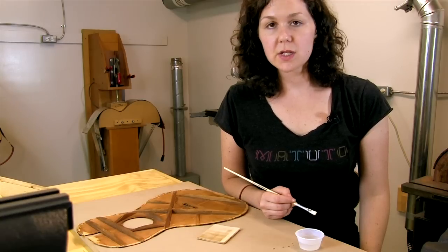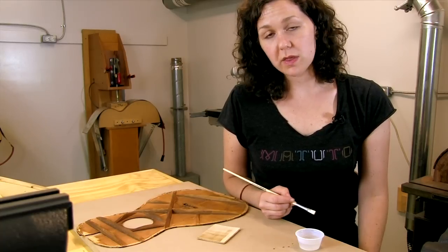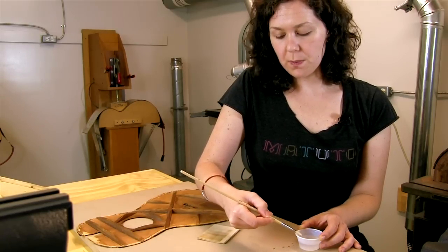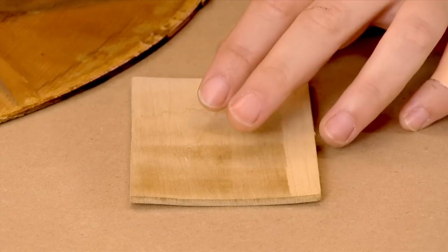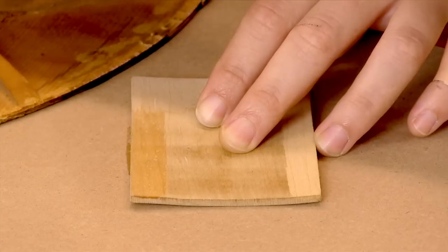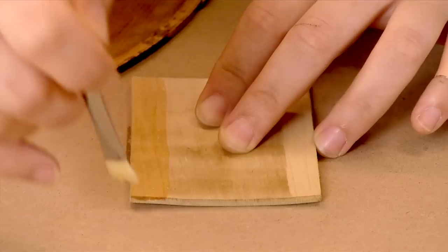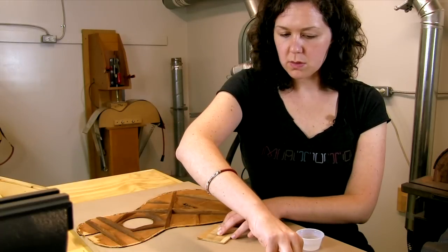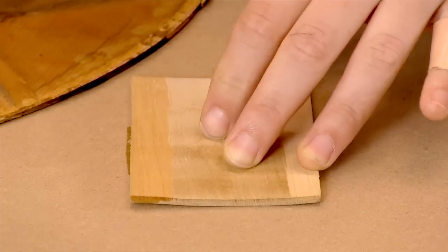What if you've pushed the potassium permanganate a little too far — oxidized your wood darker than you wanted? A way to de-oxidize wood is with oxalic acid. I'll show you on this piece of maple I had previously stained, how we can pull some of that out. I'd stained it several times from very light to dark with potassium permanganate, and now I'm just going to draw a stripe along one edge and we'll watch a lot of that come out. Even though it's wet and darker than raw wood would be, you can see that dark oxidation is already coming out.